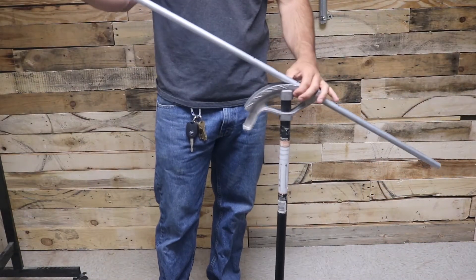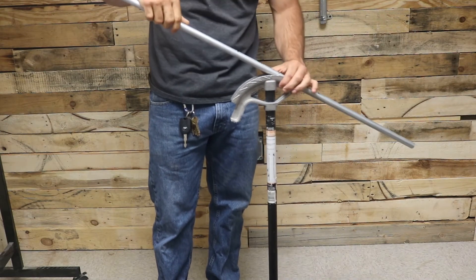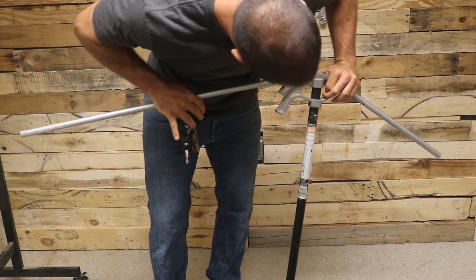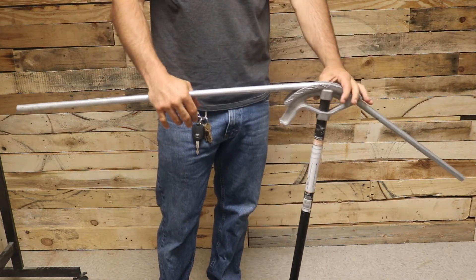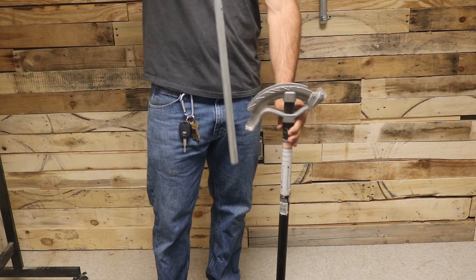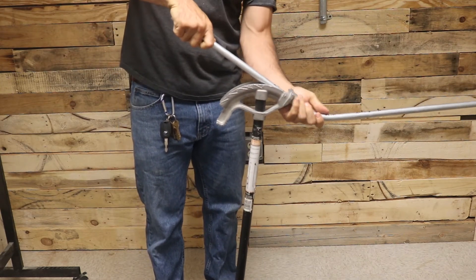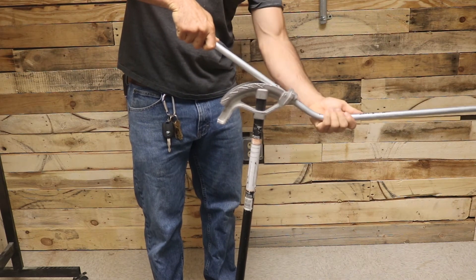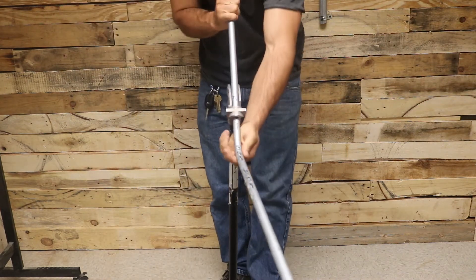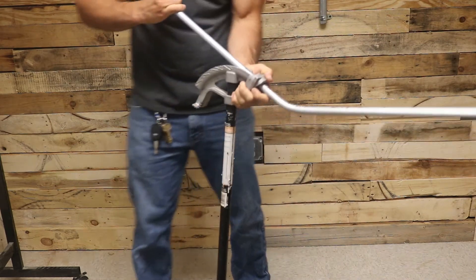When bending a saddle, I like to work with the butt of the bender on the ground and the bender up in the air. I start with my first bend, the 45 degrees, using the notch — line it up and bend it right down to 45 degrees. Notice I have the bender oriented the way I measured from. Next, I take the pipe and turn it around the opposite direction, and this time I'm going to use the arrow. Line up your pipe with the bender and make sure it's straight up and down — that first bend should be running straight with the bender.